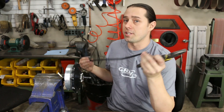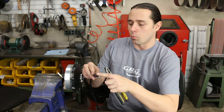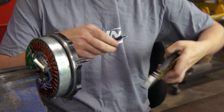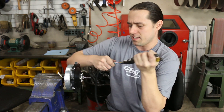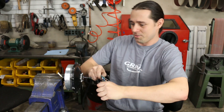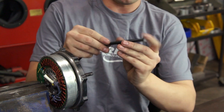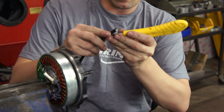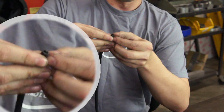I find it far more useful to prepare the cable so that the outer sheath extends beyond the inner conductors. I've exposed just a little bit of the inner conductors, taken pliers to get a good grip on them, and massaged the sheath of the cable down about eight centimeters. Then I cut it flush. Now as I return the sheath to a neutral position, I've got about eight centimeters of sheath without any cable in it. I'm going to slit a little bit along the length of that outer jacket so I can bring the cable down to a point.